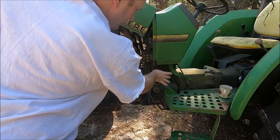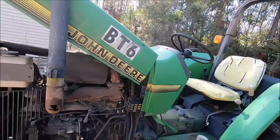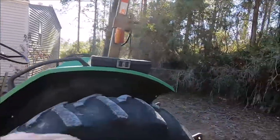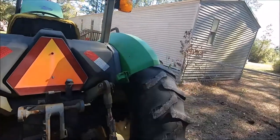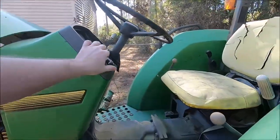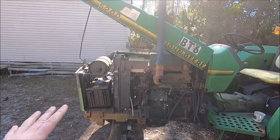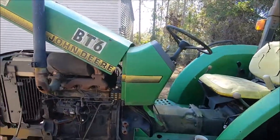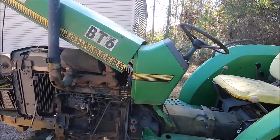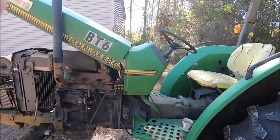I'm going to take this cover off to dig into the clutch pedal linkage. We've also got to get in here to check the wiring harness — there's not a lot of wiring on this tractor but we definitely want to try to find that voltage drain. There are lights, standard gauge package, and what I believe are turn signals. Other than that and the ignition and alternator, these things are pretty simple electrically. The switches and gauges are back here, and sometimes mice get in there and start chewing, but we'll look into that.